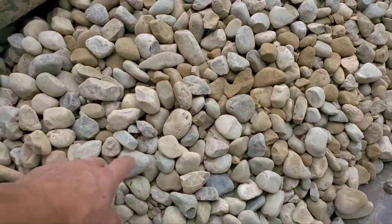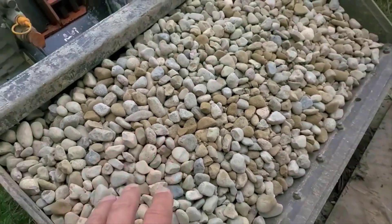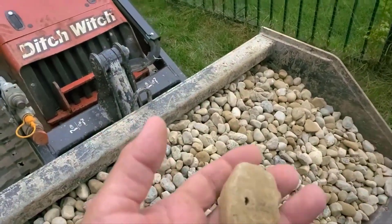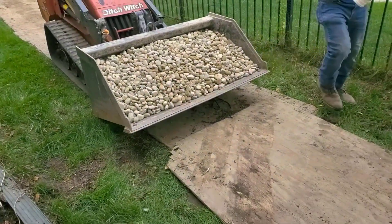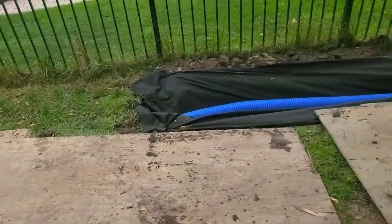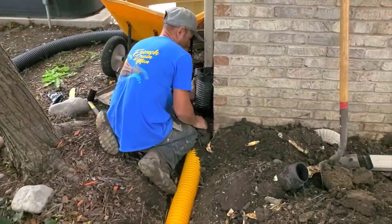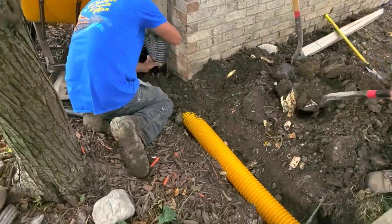The bigger the stone, the bigger the voids — look at all the voids in this big stone. This is inch and three-quarter cobble. They don't wash it anymore — notice how dirty it is. We can't get washed stone anymore. I've been talking to guys outside of Michigan, everywhere — this has become the new standard, no washed stone. They all got together somewhere and had this talk, because you're just not going to find washed stone period. Marcello's got his connection; Valentine's packing the dirt on it to keep it in place — this thing's never going to go anywhere.